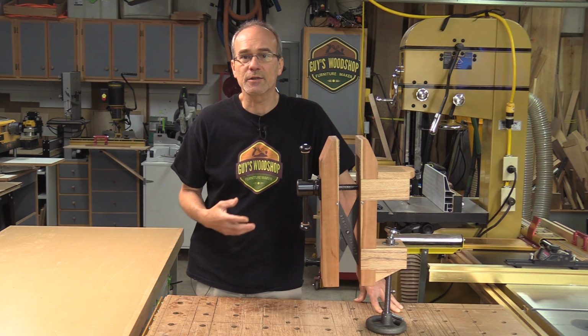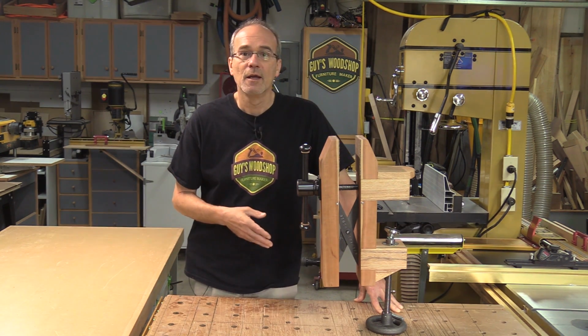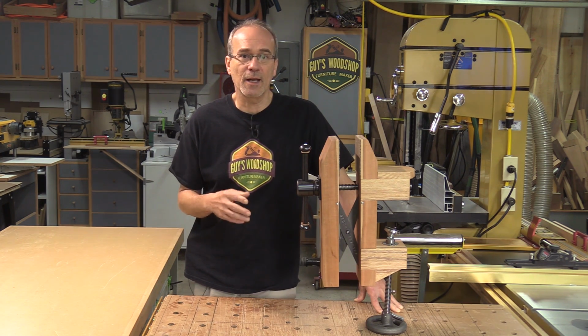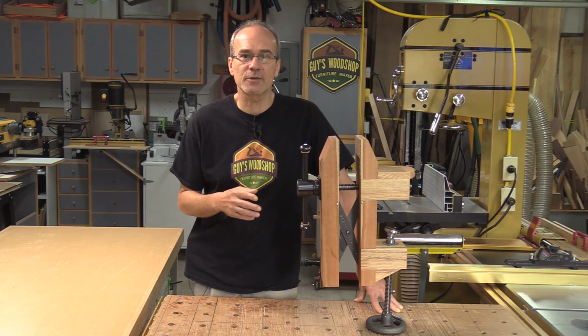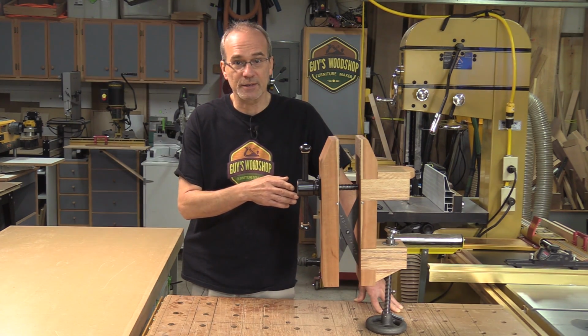Now, there's a version that has a screw clamp feature for fast clamping to your workbench, like what you see here. And there's another version that lets you use your own clamps or holdfast for securing to your bench, or to build the wooden components with a tail vise cleat for being clamped into your workbench with your existing Benchcrafted end vise. Let me show you how easy it is to install the Benchcrafted Hi Vise hardware to make the version with the screw clamp like you see here.